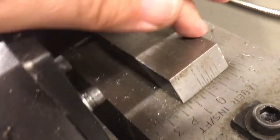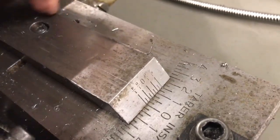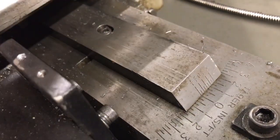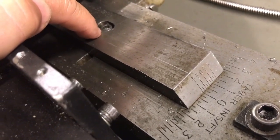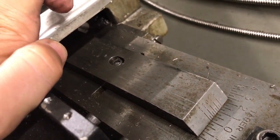One other thing I do see here — this bar is looking a little beat up in some places. I've got some burrs right here; there could also be a little bit of damage to the bar. I think when we replace this screw and the nut that goes through it, I'm going to go about taking this bar and making sure it's stoned off so there are no burrs or anything that can affect the accuracy.